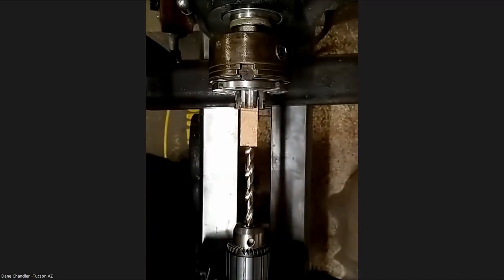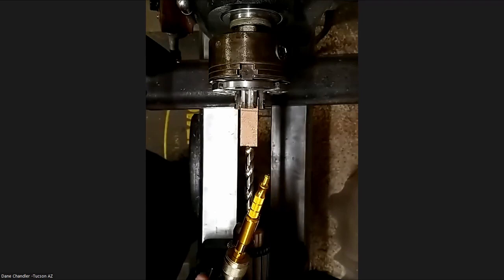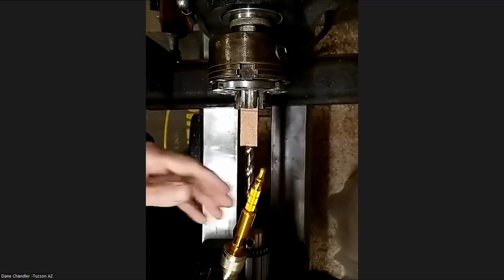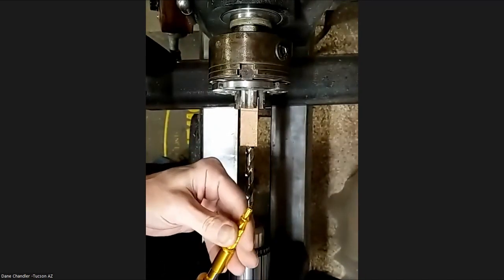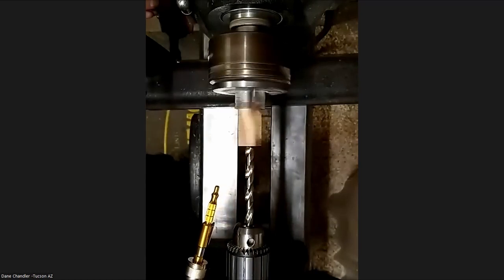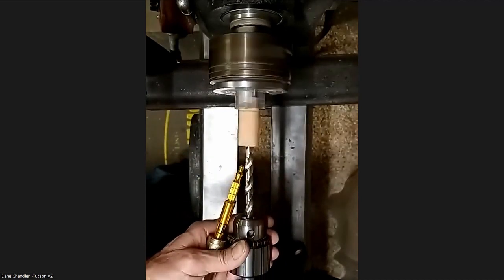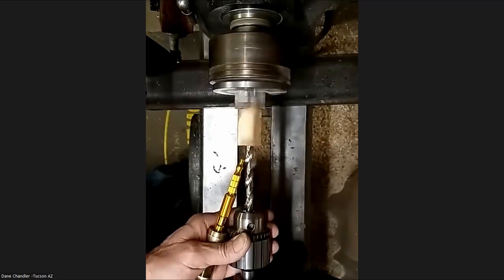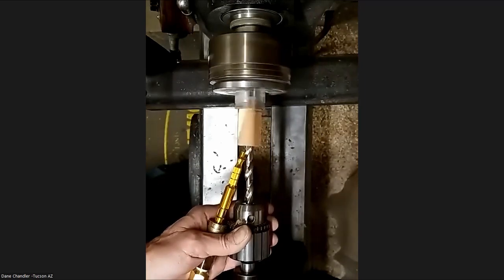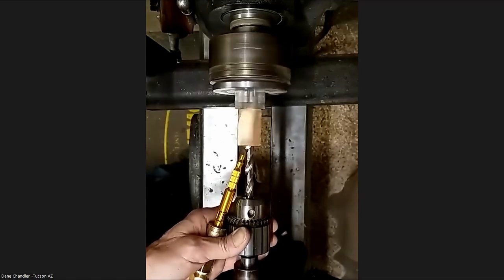Yes. Awesome. It's a smart move. No matter what you drill, put that air in because of the close tolerances of what you're working with. Absolutely. So I'm going to turn my air on, turn the lathe on. Now we're going to giddy up. So I drill about 1/4 of an inch, then back it out. Just keep repeating that process until I'm all the way through.